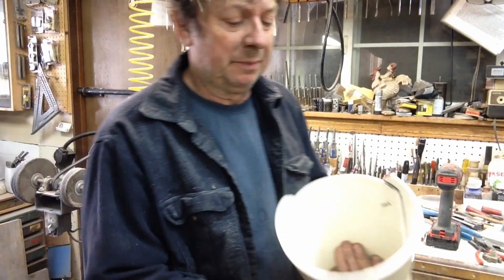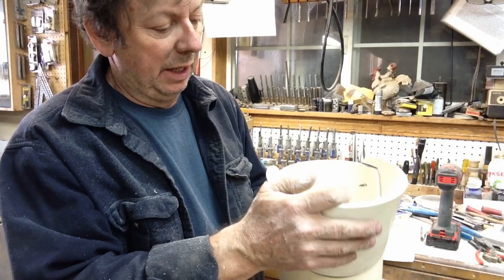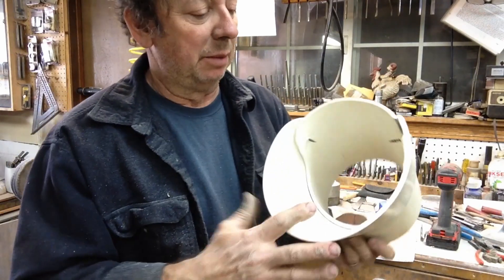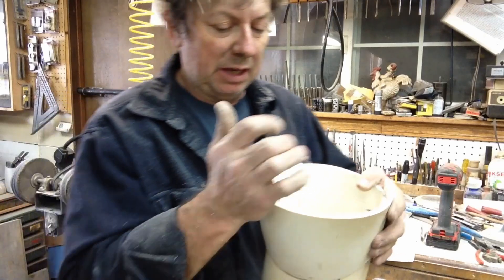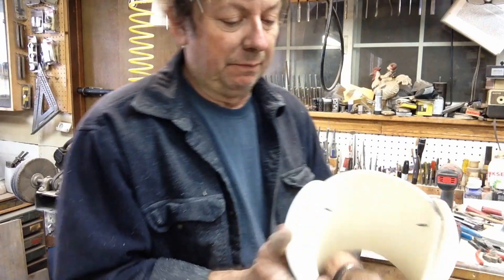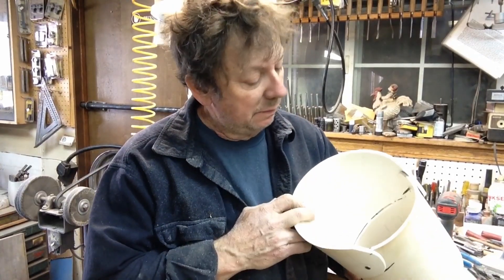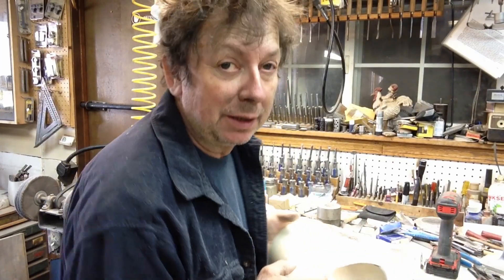I'm about to quit for the day. Here's my hopper — it still has to be contoured down through the bottom and matched up, and we'll have to affix it. I'll probably run some bolts from the inside where I've got screws right now, smooth it out a little bit, and blend the ramp down in the bottom. This will sit out in front so we'll have a bigger area to feed sand into. I may go back and heat it a bit more to spread it wider and bring it in closer, but I think it'll work fine. We'll try her out and see. Hopefully you found something at least mildly interesting — stay tuned, we'll come up with something else tomorrow. Thanks for taking the time to watch, stay safe.